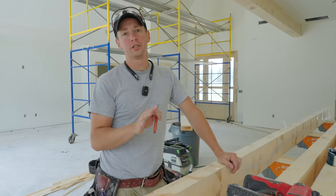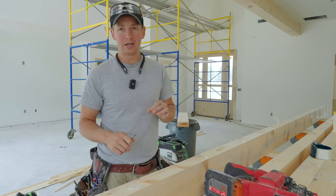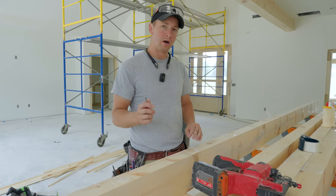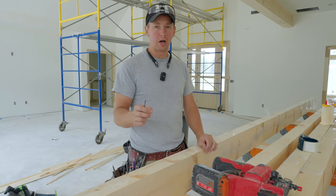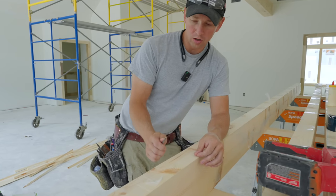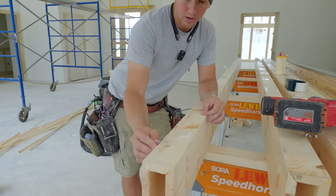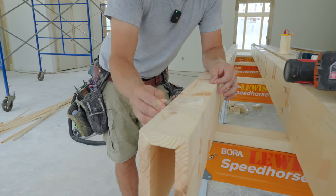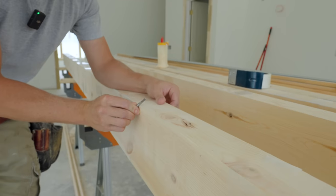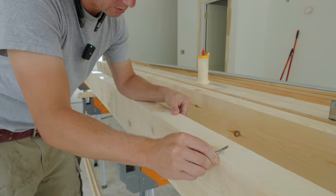Now we want to burnish that outside corner. This is an extremely important step. You want to do it at the right time. I've got most of that excess glue squeezed out. I wiped most of it off. You don't want to let your glue dry without doing this step, because if your glue dries, this corner gets really hard and you can't compress the end. So we're gonna take something round. It could be a screwdriver, chisel, whatever, and we're gonna just kind of burnish the end here. And what we're doing is we're compressing the grain on this outside corner, so it's going to go together seamlessly.